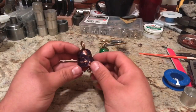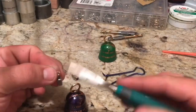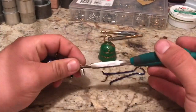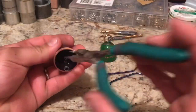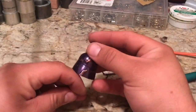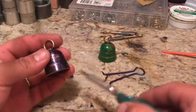All right, at this point, I've already fully cured the powder coat. I already got the powder to flow, and then I turn around and put it at 400 degrees and let it sit for 15 minutes. It's recommended, it says 10 minutes, but I always do 15 minutes. It's not going to hurt it. You can overcook powder coat, but I've noticed on my oven that the extra 5 minutes doesn't hurt it at all.